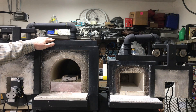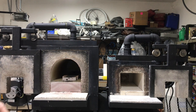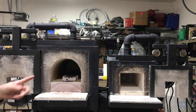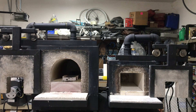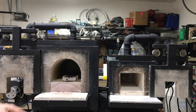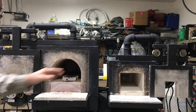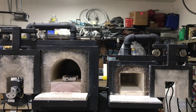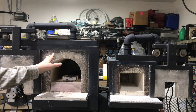It's 29 inches long, about 17 and a half inches tall, and about 16 and a half inches wide. The interior chamber runs all the way through the back end. It's 8 inches wide and about 8 and a half inches tall, and it's domed. It's lined with fire brick here on the bottom and on top, so as that wears out I can replace that without deforming the refractory.